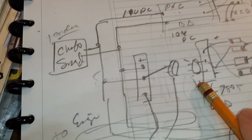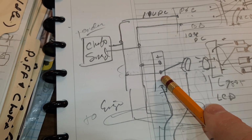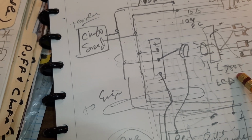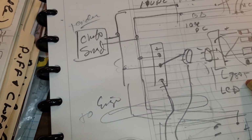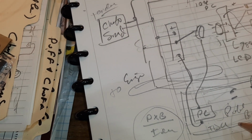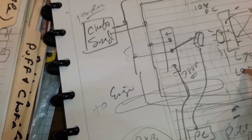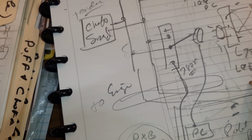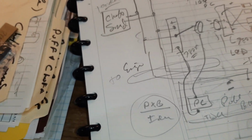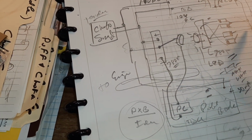So this is the game plan. A single LED at maximum power and a single receiver getting 5 volts down here. Where do I put 5 volts up there? I think that might be right. I'm going to use a pair of 5s, and I know why, because I have them. So I'm going to put 5 volts to the LED, and I'm going to tune it with that resistor. So I've got max power, max lumens. And I have to worry about that below, say 30 milliamps is the target for that. So that's the test. Set that up and test it and get it working.